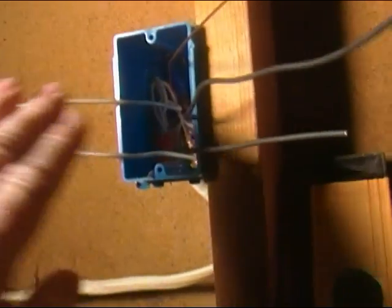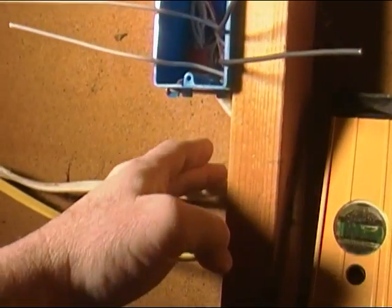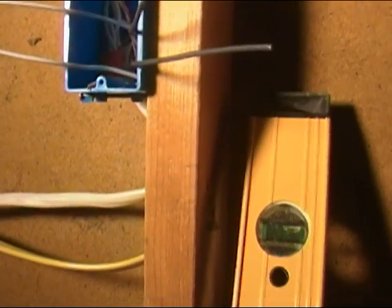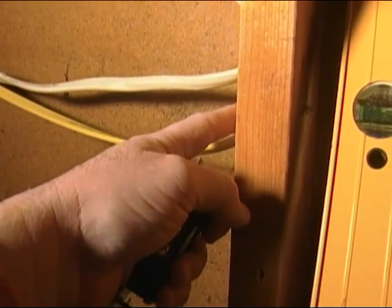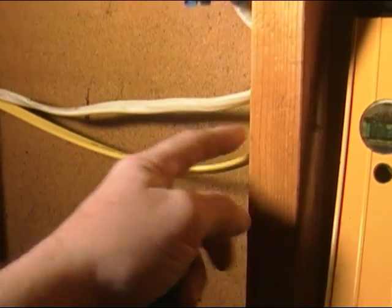The same thing with the white wire — took the white wire out of this one, the white wire out of this one, and an extra piece of white wire, stripped them back, twisted them together, and shoved them to the back of the box. So now what we've got is two black wires coming out here and two white wires and one ground wire. Those two additional wires come from our brand new circuit wire right here — just the white wire and the black wire from this new wire.